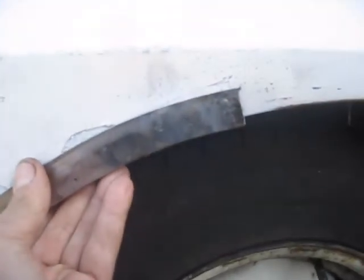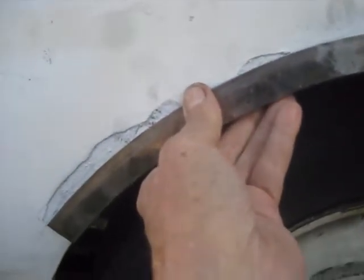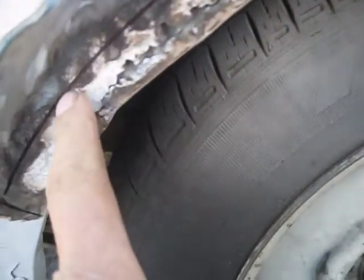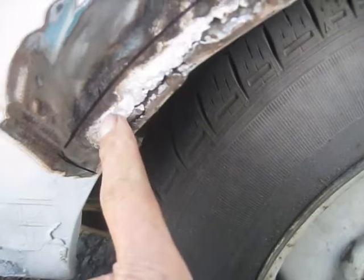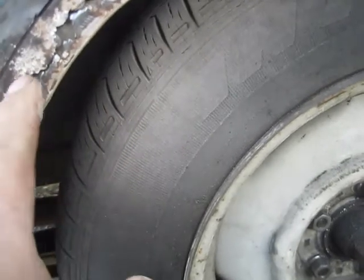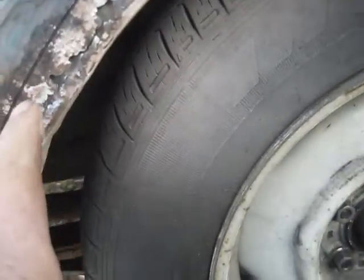So that's what I'm going to do: clean this up, mark it, and try to cut this out of here and weld this piece into the back fender. I ground this all down and marked it with a felt marker because this is sticking out too far. My metal is going to go past this mark but I'm going to cut to the inside line of this mark.